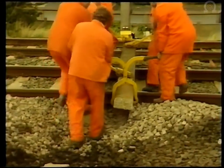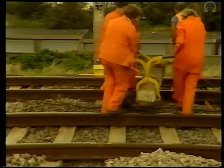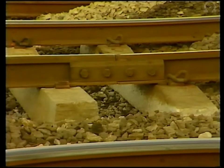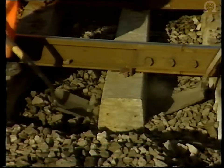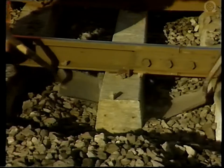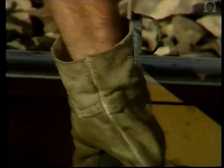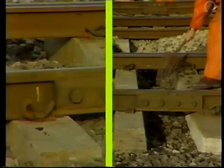Once the new sleeper has been properly secured, the damaged sleeper can be removed to the side of the track, and the gang can set about tackling the second sleeper. It's important to bear in mind that this kind of repair is carried out while the track is open for traffic, and the new sleepers should be properly supported. This is achieved by shovel packing — simply pushing the ballast underneath the sides of the sleepers with shovels. The top of the track must be at the correct cross level. The sleepers are raised and lowered using jacks on the rails according to the levels shown on the cross-level gauge, then temporarily boxed in with ballast for added stability so the track is able to support traffic with complete safety.